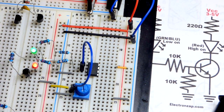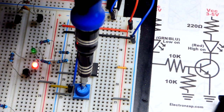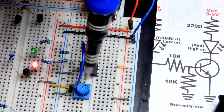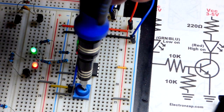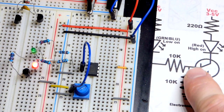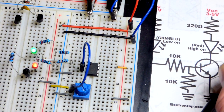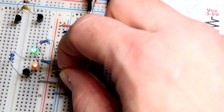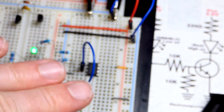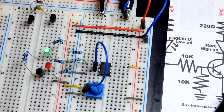Here you can see a problem — we have both LEDs on right now. With the output we can get it high enough that one goes off, but the signal is still not quite strong enough due to op-amp characteristics. So we're going to take a 10 kilohm resistor and put it to the negative rail and then to the base — that's a pull-down resistor that helps hold the base voltage low when we don't have a high output.